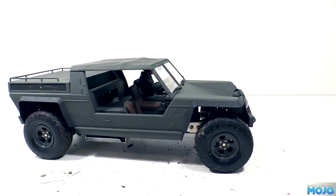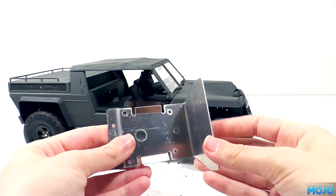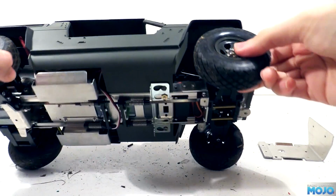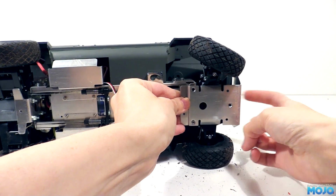To get a nice bend, the bottom of the plate needs to get clamped between some wood in a vise and the front bent up to a nice 90 degrees. It should fit quite nicely, but the front is far too big, so we need to measure the clearance required.